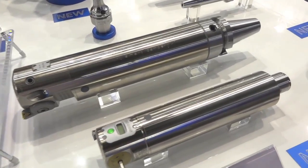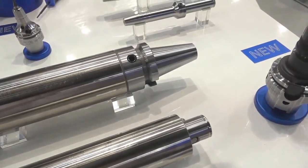Productivity is key, as is quality. To improve feed rates, the smart damper allows the customer to use a larger cutting insert, which means they can go to a higher feed rate, a larger depth of cut, and usually get a much better surface finish with a larger radius tool.